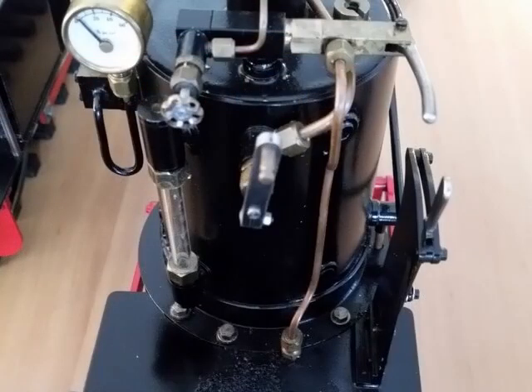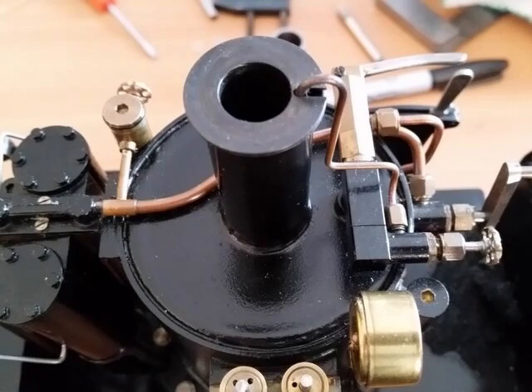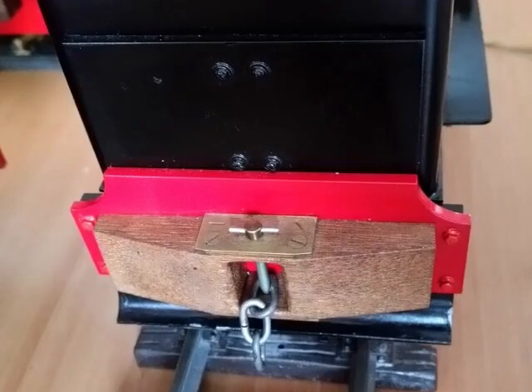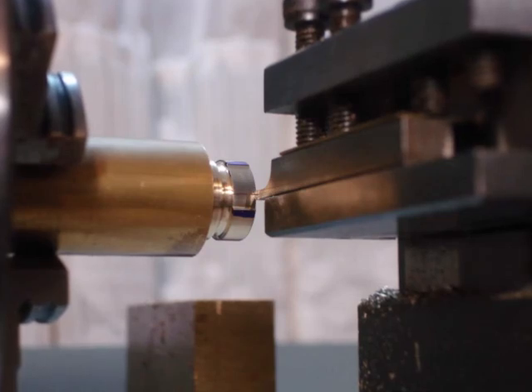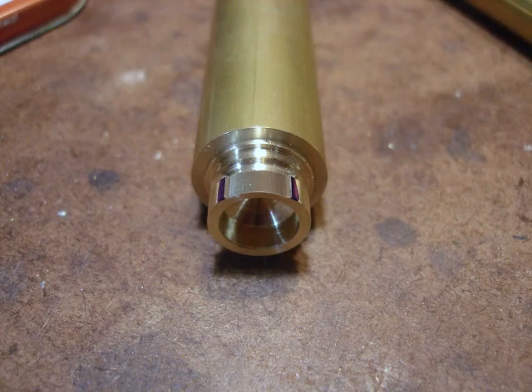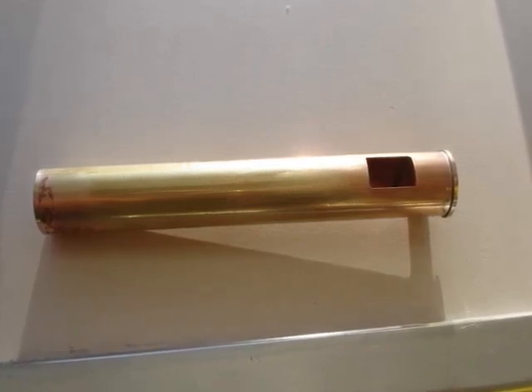This is how the whistle pipe is routed — I conquered my dislike of boring holes in the footplate. The two safety valves: I restricted the outlet on the first so that the second would lift on occasion. The steel chimney adapter for the steam-raising fan — I carefully remove it when there's enough steam for the blower. Real coal in the bunker. I handmade the three-link chains from 2mm steel. In 2010 I made a new whistle, which has turned out to be my best whistle. Here I am planing the slot with a lathe tool on its side. The finished slot for the whistle block, and the finished whistle carefully soldered so as not to fill the steam passages with solder — this is what plagued the first whistle.